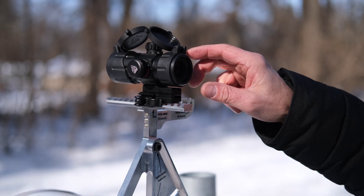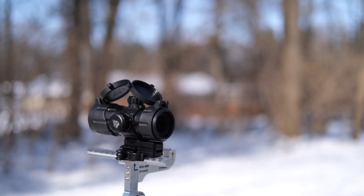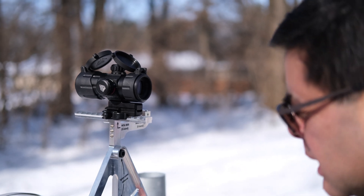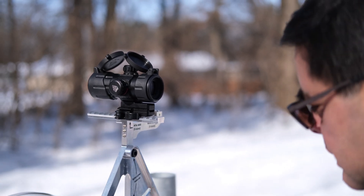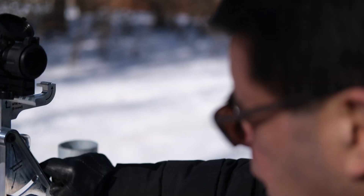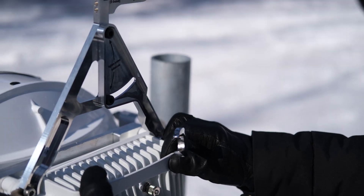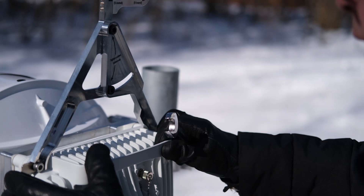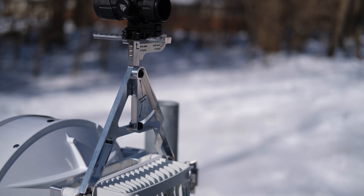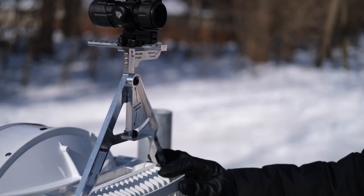Since this one's been pre-calibrated, I can now go through and do a rough alignment. I'll look through here and I can see the red dot, and I'm just going to adjust it by hand to put the dot right on the far end antenna. This is our coarse alignment, and it will get us close enough to bring up the radio link. We're still going to use the volt meter to do our final alignment, but the scope will save many hours of getting the initial alignment going.